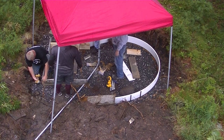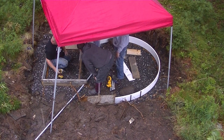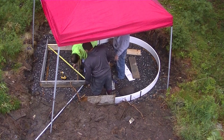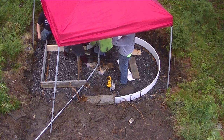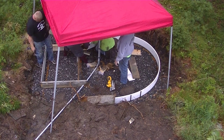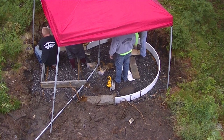Luke's getting those corners screwed together, and we're going to put a temporary cross piece in so we can get this thing square. To square it, I'm going corner to corner making sure I've got the exact same measurement each way. Since we got that square, Luke's pinning the corners to make sure it doesn't move. We'll set everything to grade after we get it all pinned — but first we just need the box squared and the circular part squared up with the box so it looks circular and not oval.